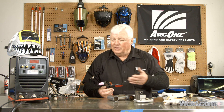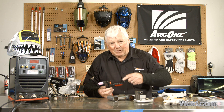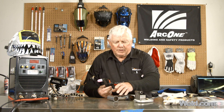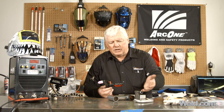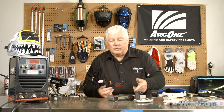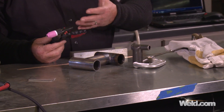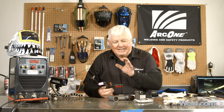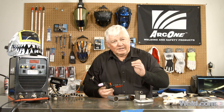You can do multiple passes. Duty cycle is always arguable — this is probably 30 to 35% duty cycle. But you can just see by the amount of time I'm welding that it's got a pretty decent duty cycle. I'm going to do what I call thick to thin — this is just a steering bracket. I've got 4130, 060 wall to 125, and it's a pretty heavy duty bracket. We're only going to talk about DC in this particular episode so I can get it all in in a very short film. Let me get my gear on and do a couple of demos for you on DC only.